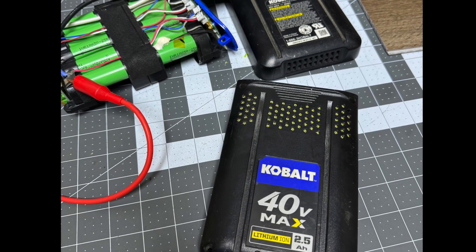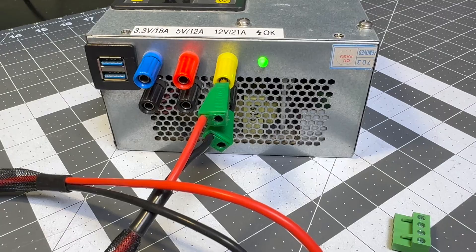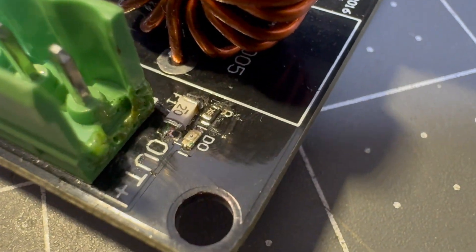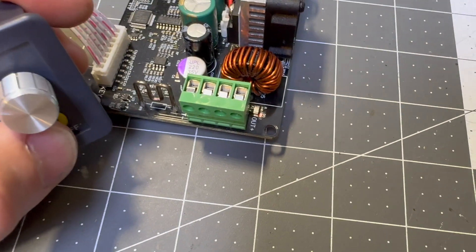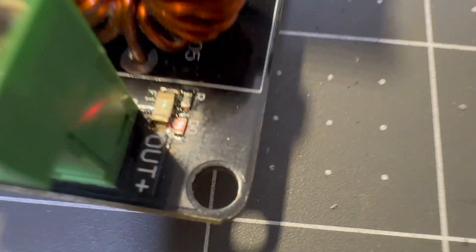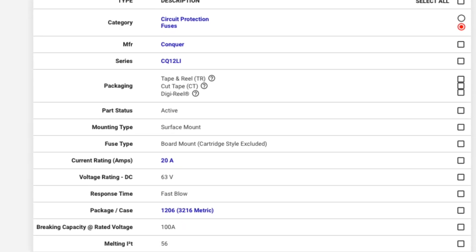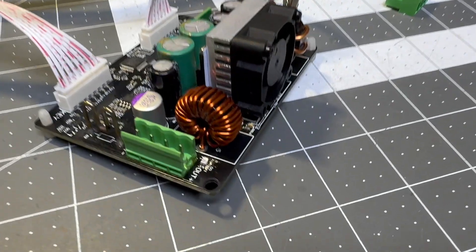But then eventually I connected its outputs backwards as well — this time to a 40 volt battery. Same pop, but fortunately no smoke. This time I hooked up the buck-boost circuit outside of the ATX case and I saw what I hadn't seen before: an LED. I quickly found out that the LED was meant to signal when the nearby fuse was blown. I had never seen this LED before because I had never powered the board up outside of the ATX case with a blown fuse. The fuse was right next to the LED and a continuity test quickly confirmed it was bad. I ordered a new fuse from DigiKey, soldered it on, and everything worked again. I also went ahead and repaired my older DPH3205 that I had sitting in a drawer — it simply had a blown fuse as well, so it was back in business.